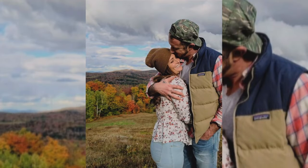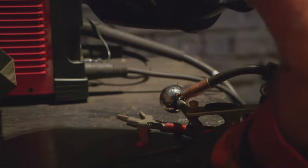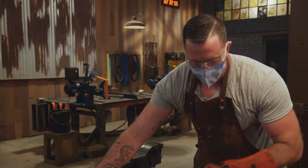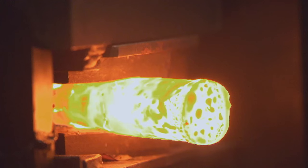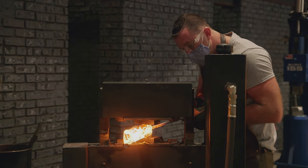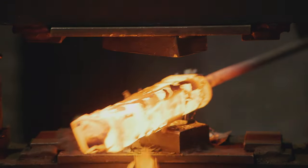My name's Kyle Ferreis. I'm 34 years old. I met my wife about a year and a half ago and she introduced me to bladesmithing — we actually forged our own wedding rings. I get all these materials in front of me and I'm going to break them down as small as I can to fit them into the canister. I get the big ball bearing broken down into thirds but it's still not fitting, so I've got to take more pieces off. Normally you'd use a square can so when you're putting it through the press to forge weld, you'd get nice even pressure. With a tube, you're not going to get that, so I'm going to work it slow — like packing a snowball nice and hard.